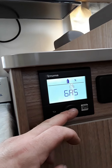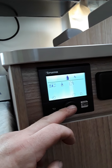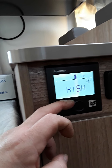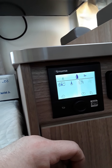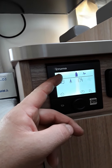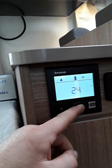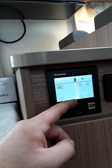You have element electric 1 and element electric 2. If you want gas, click on the gas. Over here is your fan — it controls the speed. Click on it, scroll to your fan, click on it, and you have eco, high, and there is a boost option that comes up at certain temperatures. If you want high, click on that and that is your heating working on gas. If you have no icons above this line, you are doing nothing — so always make sure to click the button to confirm what mode you want on.